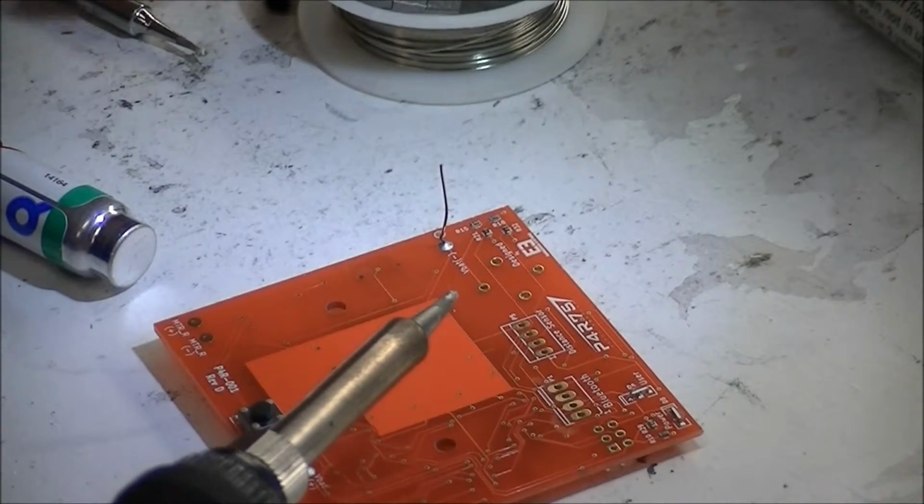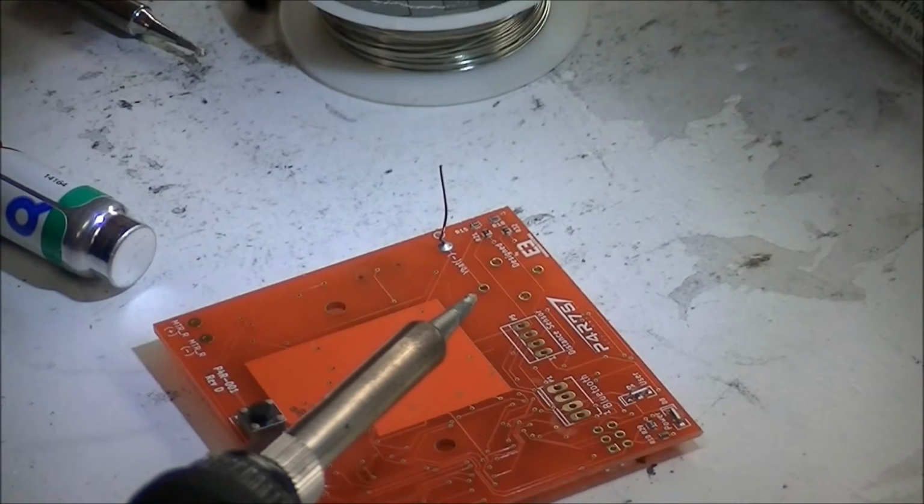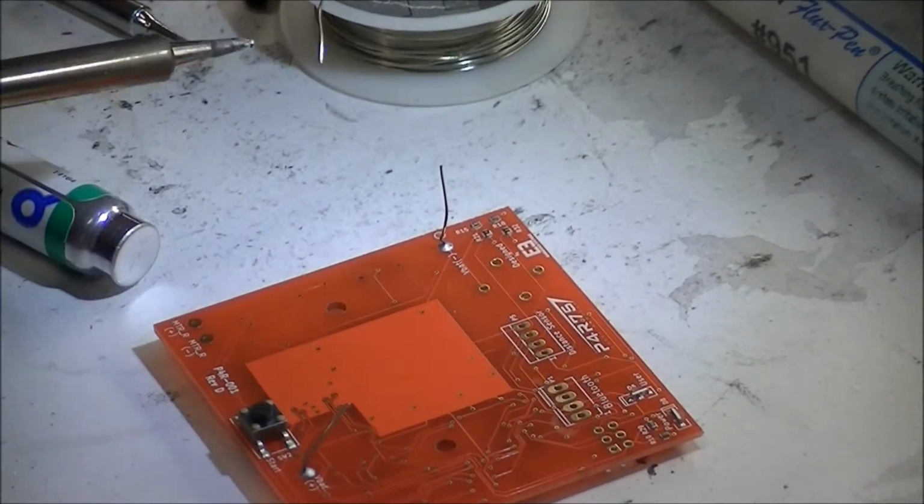If the solder wire is too large, you will not be able to control your feed rate properly, and also a large diameter solder may pull too much heat away to maintain correct temperature on your joint.